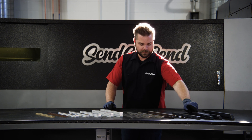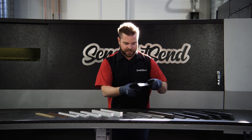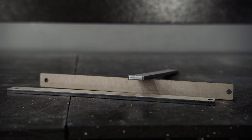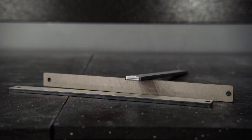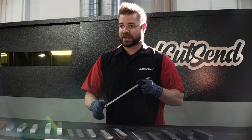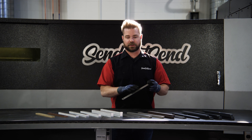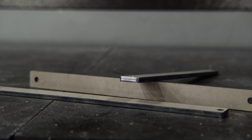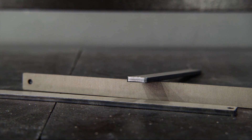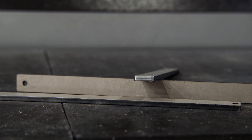So keep that in mind when ordering AR — if appearance is really important, you may have to powder coat or paint it. Let's take a look at something cut on oxygen. This is a good example — this is quarter inch HR P&O steel. HR P&O is hot rolled, then pickled and oiled. The pickling and oiling process removes a lot of that mill scale, so it's ready to weld, ready to go — you don't have to spend hours with a flat disc trying to grind it off. The edge was cut using oxygen as an assist gas, so it leaves a little bit of a glassy oxide that will need to be removed if you're going to weld or paint it, because that stuff will flake off.